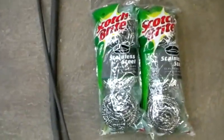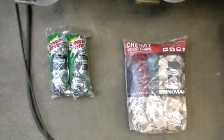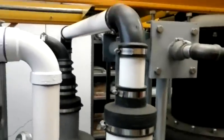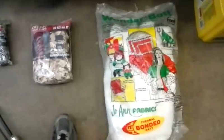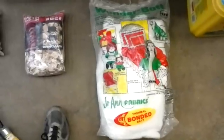The gas will come into the first filter, which is filled with stainless pot scrubbers — these ones right here from Walmart, just picked up a couple of weeks ago. It comes out the top of the first filter, goes down into the second filter, which is filled with wood chips. I didn't really want to buy smoking wood chips, but I didn't have any available so that's what I ended up getting just for now. It comes out the top of the second filter, goes into the bottom of the third filter, which is filled with polyester fiber material — probably from like 1950, Joanne Fabrics.